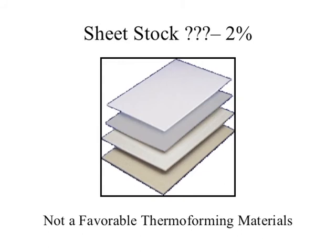We've empirically shifted material choices in northern states based on cold breakage. If we were very sophisticated, we would have developed a cold-temperature-use polypropylene with a lower glass transition temperature. But because we're such a small field and our material usage volumes are dispersed through many distributors, no single distributor will take on the economic challenge of developing that low-temperature polypropylene — it just doesn't have enough economic viability. Homopolymer polypropylene is used very little in mainstream industrial thermoforming because of the processing difficulty of that quick solid-to-melt transition and lack of good sag strength.